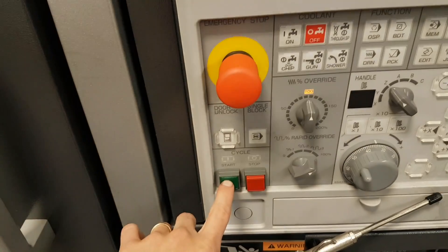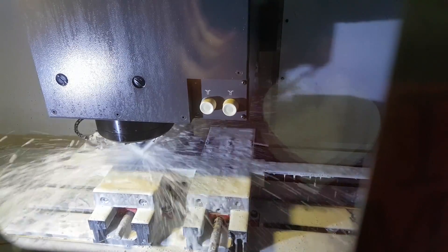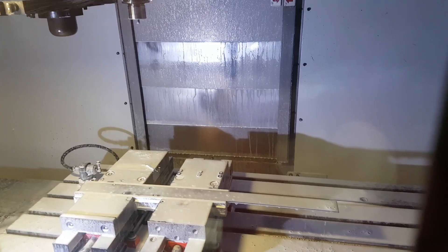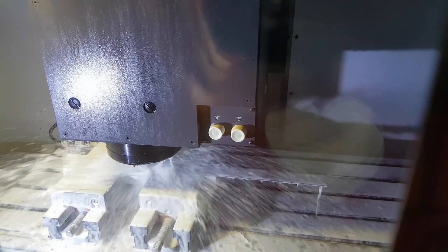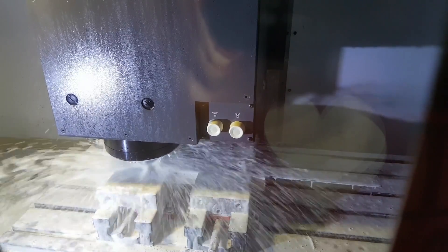Got my code: drill two Norseman blades. Cycle start. Drilling pretty slow — 700 RPM, two inches per minute with a cobalt drill bit. I could probably go more aggressive; I could use carbide and go way faster, but I don't really care. Three holes per blade plus one entry hole. Now I'm using a five-flute Lakeshore Carbide quarter-inch variable-flute end mill. I shove it down into the pre-drilled hole and slot it right across. End mills don't really like to drill, so if I can create a pre-drilled hole I always like to do that.